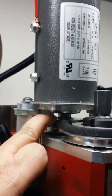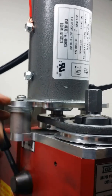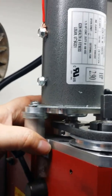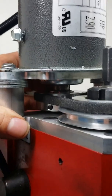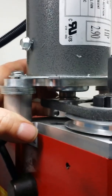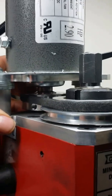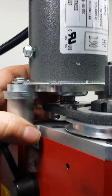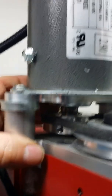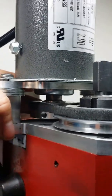I'd already converted to the belt drive system from Little Machine Shop, which had two pulleys on the drive. When opening the pulley bore up to 0.66 inches to adapt the shaft, you basically lose one of those pulleys, but you don't really need it anyway. I drilled four set screws on the pulley since there's no keyway.